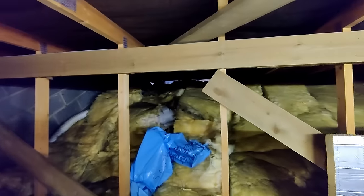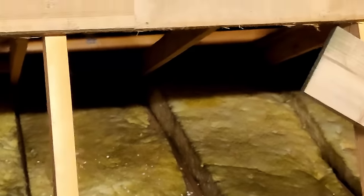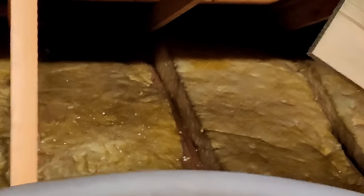You can see how far back - there is a lot of breathing room there. I know you need to leave a gap for ventilation, but some of these gaps look excessive and then some of them look non-existent, so I need to get in there on my hands and knees and do some evaluation. Some of the insulation is not even between the joists at all, as you can see - sitting really high there.